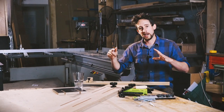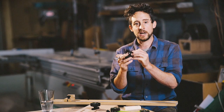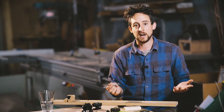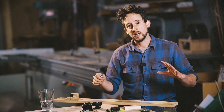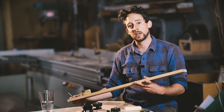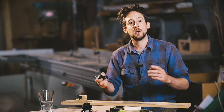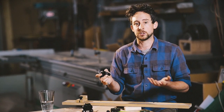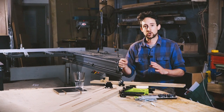The last use I want to suggest is twofold. If you have a drill press platform with t-track rather than a miter slot, you can set the locking miter bar aside and use all the t-track bolts that come with this kit to create any hold-downs or fastenings you need on standard t-track — so it is multi-purpose in that sense. Second, if you have a drill press table without any t-track, rather than buying aluminium t-track you can just route a 19mm channel and use the locking bar instead. You don't need to put aluminium everywhere or screw it down — just route that channel, and you can lock these in place and create hold-downs wherever you need without installing a whole t-track set.